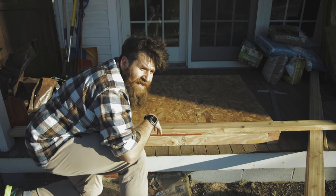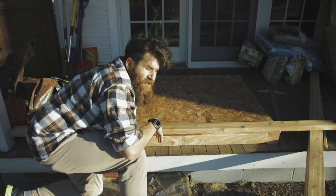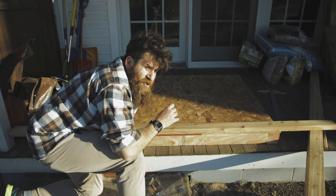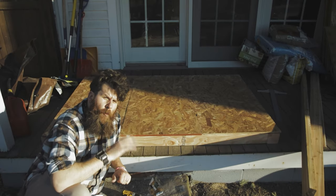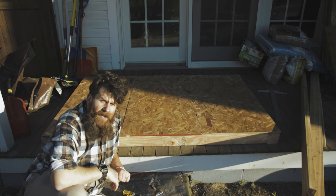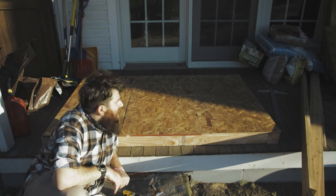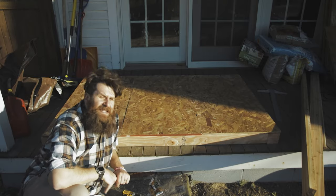The only downside to finishing nails is that if you're not good at putting them in, you will bend them, then you have to pull it out and put a new one in — if you do that too many times you're going to ruin your wood. You can always sand it afterwards to get those blemishes out, but you kind of can't win: screws don't look good and take a lot of time to hide, or you go with finishing nails which are less visible but easier to mess up. You just kind of have to practice. I think we're going to go with the corners and then every foot around the table — so on the four-foot side, screws on the corners and then three more a foot apart, and going down the side, five or six more screws centered between the corners.